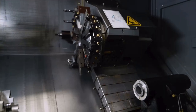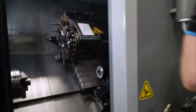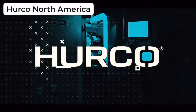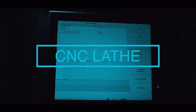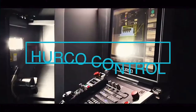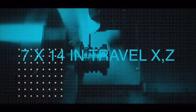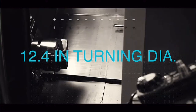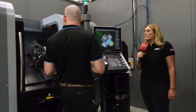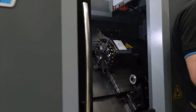Some of the features on this machine include a Renishaw touch probe. The Renishaw touch probe for the tools is actually a standard feature on this machine. Other features include DXF. The bar feeder is an option if you want, although you can use a bar puller on this machine. You've got a 12 station turret with a choice of VDI or standard slotted tool holders, 20 by 20 tool holders, and a max spindle speed of 6000 RPM — that's a very quick machine.